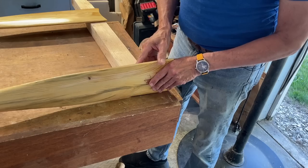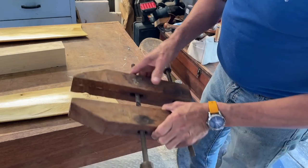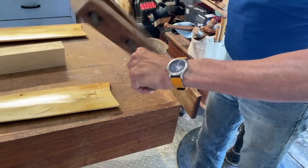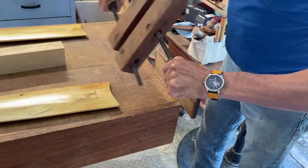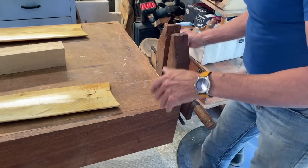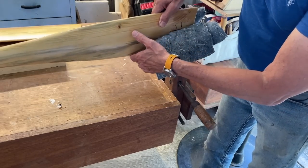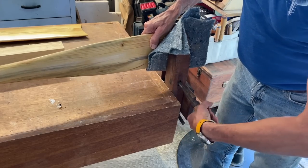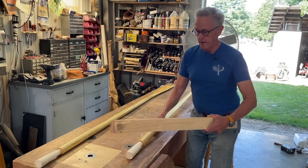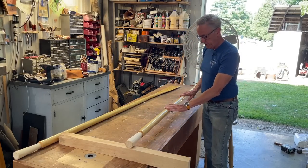In order to keep this in position, I'm going to take a cabinet clamp and put it in my vise, get it close to the width of the blade, and add a little softener so it doesn't damage the oar. I'm also going to use this piece of spruce to hold the handle up so I've got a nice surface to work on the leathers.